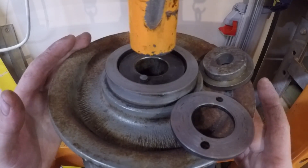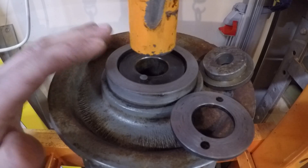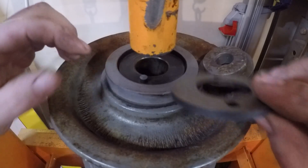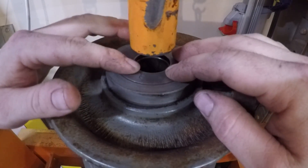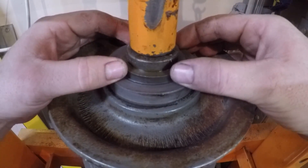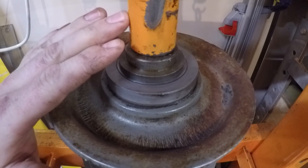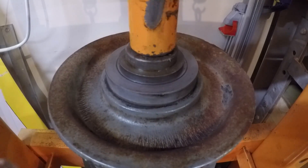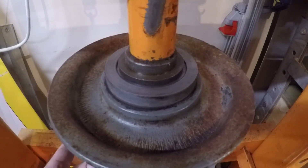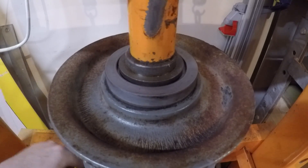I have the roller positioned in the press, supported around the center hub on the bottom side — I don't like pressing on the roller flange; the center hub is a lot sturdier for this type of pressure. To protect the alignment dowels for the thrust washers, I'll place a thrust washer back over them. This is just a real cheap 20-ton hydraulic press and it handles these bushings just fine. I'll apply pressure to the bushing, let it drift down, contact the lower bushing, and drive them both right out the bottom.